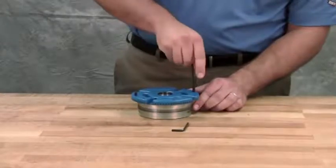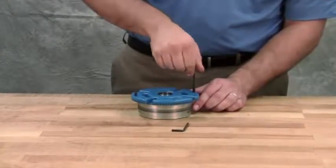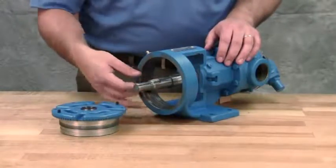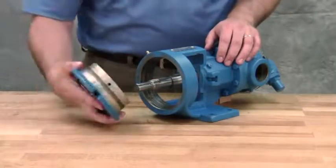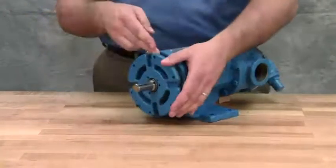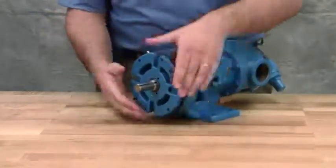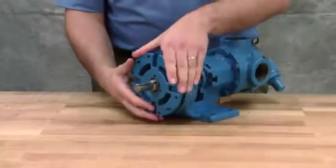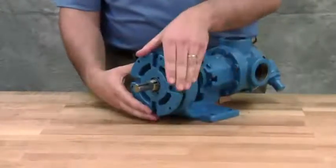H and HL sized pump bearing spacer collars are not recessed and do not have the half round rings. Slide the inner spacer collar over the shaft with the recessed end facing the rotor. Place a pair of half-round rings on the shaft and slide the inner bearing spacer collar over the half-round rings to lock them into place. Turn the bearing housing into the bracket.